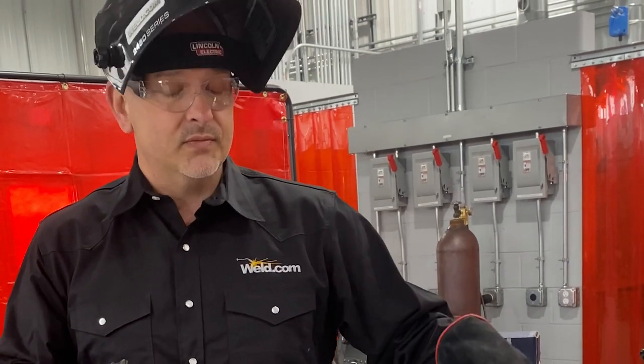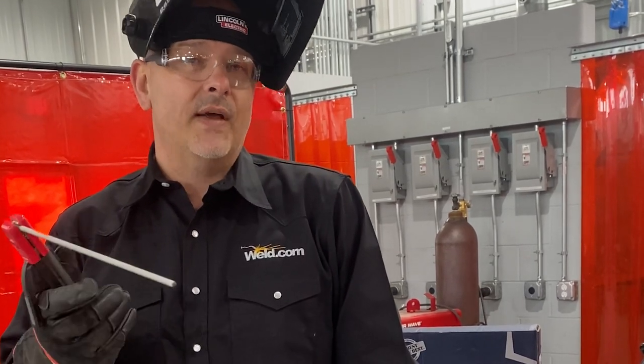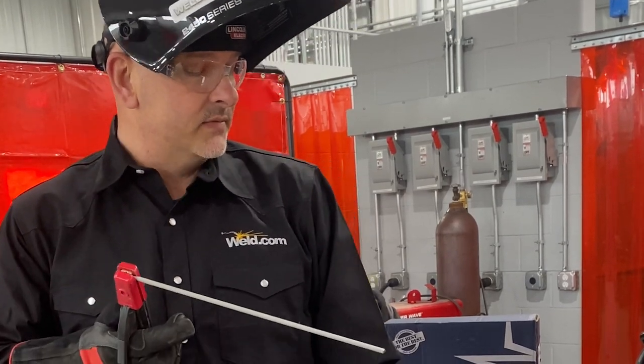Make them at least 6 inches long. And once you get experience, make them 8, 10, 12 inches long. That way you have starts and stops, and you have to learn how to correctly start and stop your weld. That's a completely different video, different topic. We won't get into that today, but we're just talking about how to properly run this T-joint.